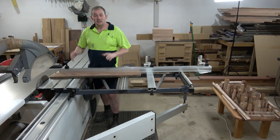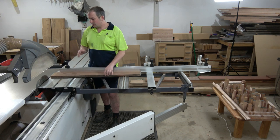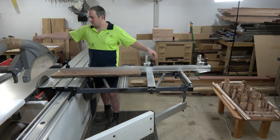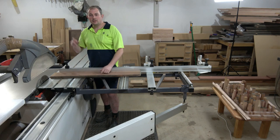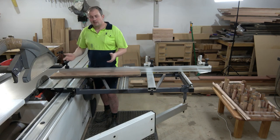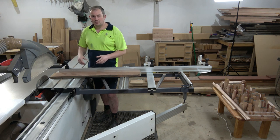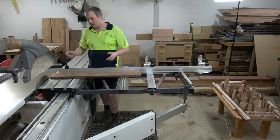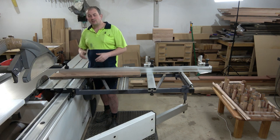Other things to consider: you need the physical space for a slider. My garage isn't huge — bigger than standard but not massive — and this machine takes up a huge part of it. The stationary footprint is about 3.6 metres wide by 2.5 metres, and the working area is 3.6 by 5 metres. A table saw isn't as wide but it's still as long, because you still want 2500mm behind you and 2500mm in front of you — so it still takes up quite a bit of room.